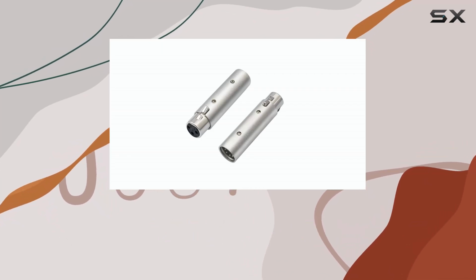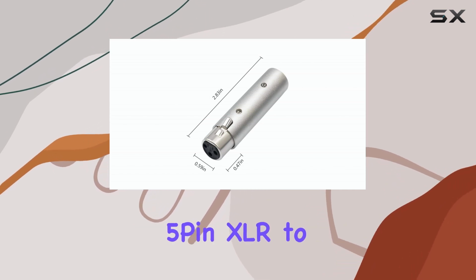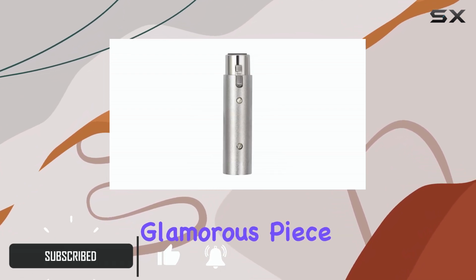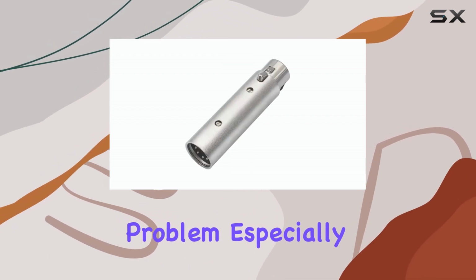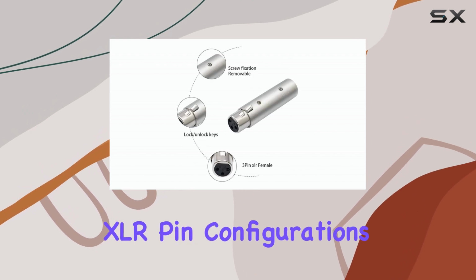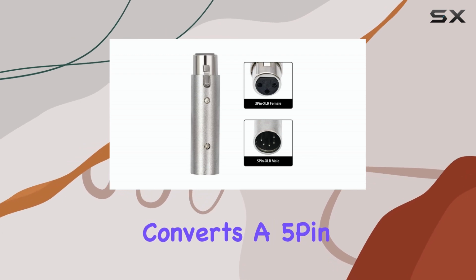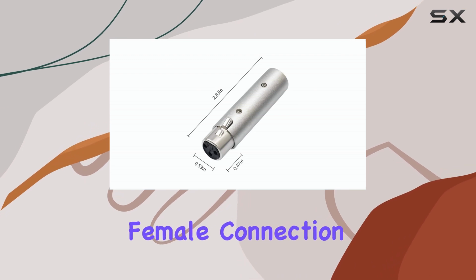Today we're taking a look at a really handy little piece of gear, the male 5-pin XLR to female 3-pin XLR DMX converter adapter. This isn't the most glamorous piece of equipment, but it solves a very common problem, especially if you're working with stage lighting or certain audio setups that use different XLR pin configurations. What this adapter does is exactly what it says on the tin. It converts a 5-pin XLR male connection to a 3-pin XLR female connection.